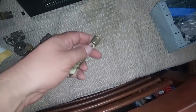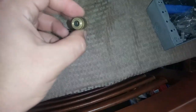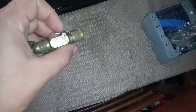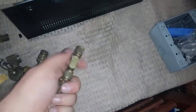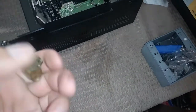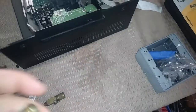These are low loss fittings too, I believe. Kind of took me a minute to figure out what these would be, because it's got kind of a quick-connect action here. I'm pretty sure they're designed for you to thread this onto the service port. You'd probably install it normally with it assembled like this — tighten it up, and then your gauge hooks up on this end. They have kind of a short flare, so you hook your hose on the end there, and then when you go to disconnect the hose you pull that lever and pull it, leaving this collar threaded on there so the disconnect action would be really quick.